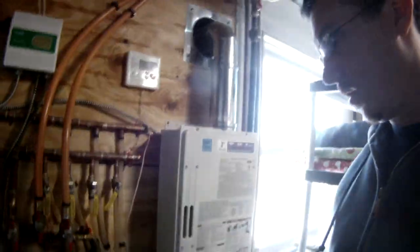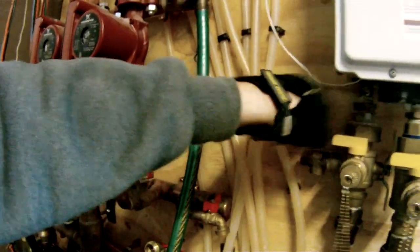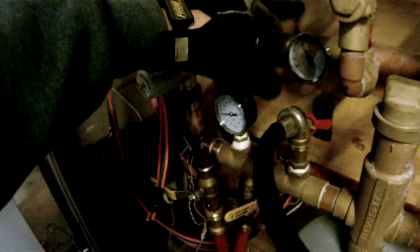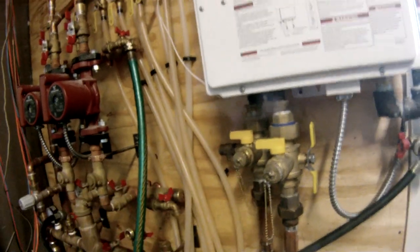I'm done, which is awesome. The change was I took out everything related to the old heat exchanger setup and hooked it up directly. So this is my supply — it's red, goes right in here. I've got a pressure relief valve, fill boiler drain, shut off, air vent, expansion tank, drain valve, pressure gauge, mixing valve, temperature gauge, zones, drain, and fill. This is the return side — I'm using it right now as a drain. I've got my hot and cold lines coming down and I put in a boiler drain so I could use it to fill the system and do my purge tasks with the hot water.